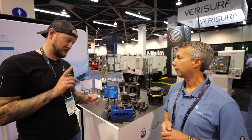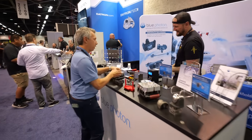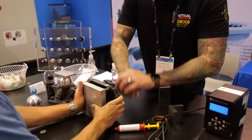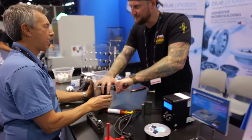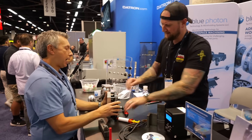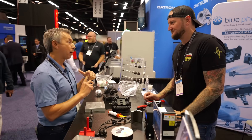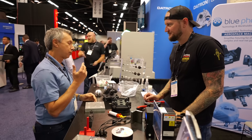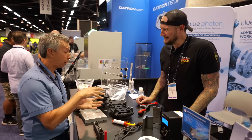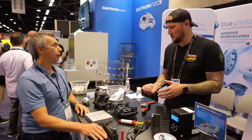The one question I've got to ask — once that part's on there and it's solidified, how do I get it off? From a standpoint of a simple five-axis fixture, you're going to do the de-bonding. Literally, all I've got to do is just hit it? That's it. So that adhesive has actually turned into a form of acrylic — and that's nothing to get rid of. It holds that tensile, but you're not fighting this for three days. That is the secret in our sauce — the way that the adhesive de-bonds. That de-bonding method really helps speed the process to move the part. That was insanely fast. If you'd use something like two-part epoxy, you'd be cutting that off with a hacksaw and destroying it.